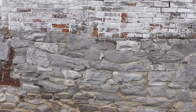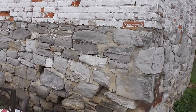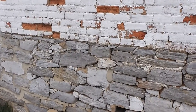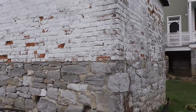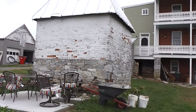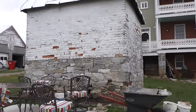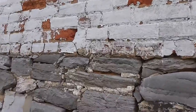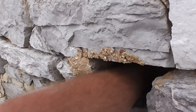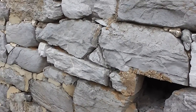When that doesn't happen, the lime mortar turns to dust or sand and just spills out. So we're going to remove all the concrete after we fill the void in the walls. Right now this smokehouse looks secure and strong, but the stone part is mainly two walls — one on the inside and one on the outside — each standing independently, and in the middle there's virtually nothing. I can show that by going over to this hole — I can stick my hand in as a fist and go straight in right up to my elbow. A little bit scary, but that's reality at this point, so we're going to fill that.